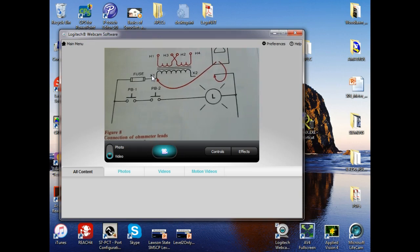So what we're going to do, if I want to check the short circuit, if I left my transformer hooked up, it would look like a short. It might measure 2, 3, 4 ohms, right? It's going to measure something because there's a lot of wire in there. But since this is a step-down transformer, your primary will measure more than your secondary, because there's more turns in your primary, right? Even if we do a divide by 2, divide by 4, your primary would measure twice what it normally would measure across this point of coil.